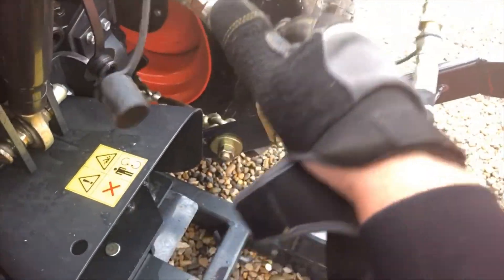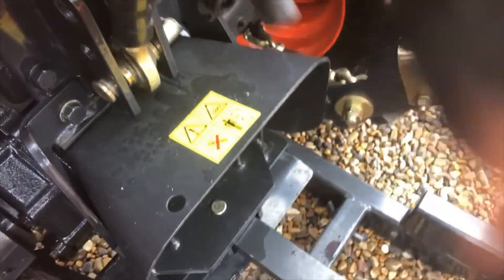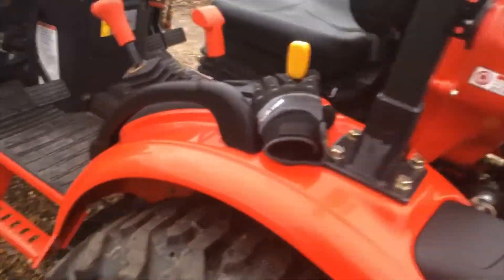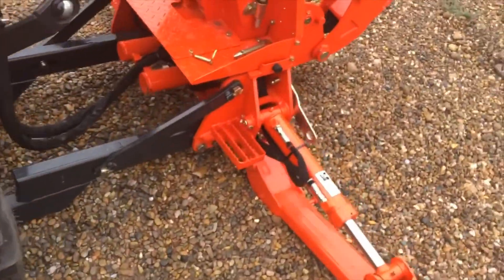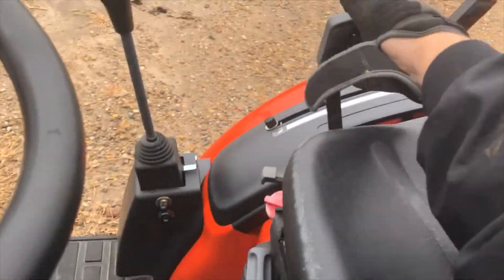You can plug the hoses in either direction, either side. Got that one in on top — it's kind of hard to do with one hand, so let me put the foam down. Both your lines are hooked up. Turn the tractor back on and come to the backhoe and lift it up into place. Remember to turn the power back on — it will only work one way, so if you come to the backhoe and it's not moving, you know you've got to flip it to the other way.